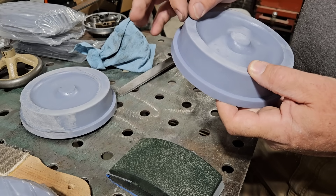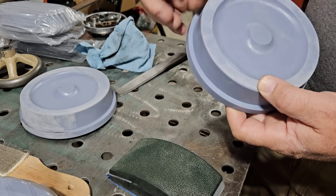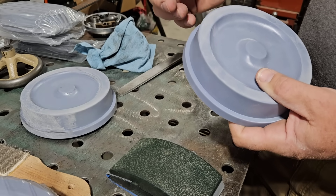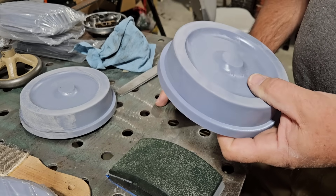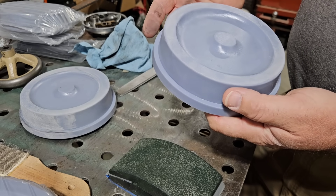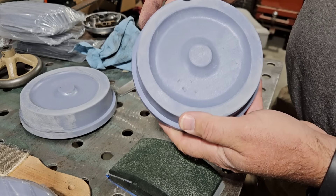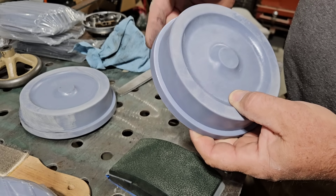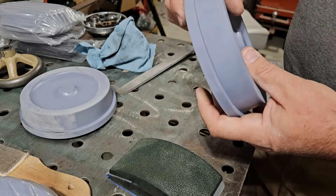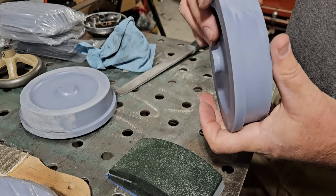And I added a little bit extra — enough material to machine. There is a bit of a rind on it, kind of like when you bake bread there's a crust on it — that's what you end up with with a cast iron part too. There's a bit of a crust on the outer edge that's a little bit harder than the rest of it, and you've got to machine through that to get to the more easily machinable surface.